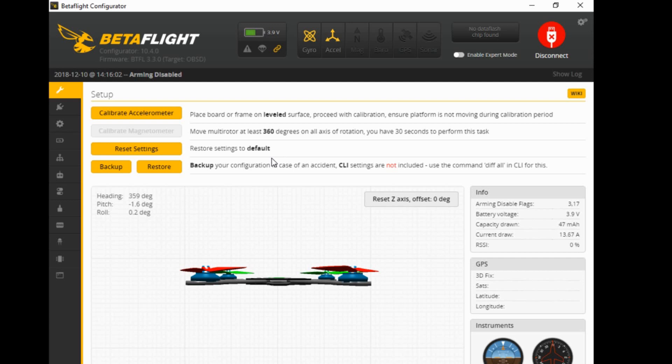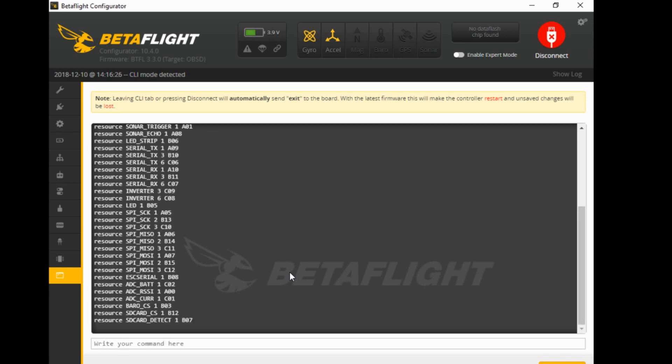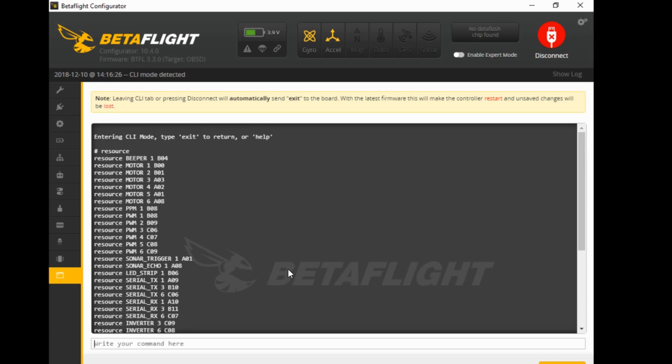So how do you switch it around? It's not that difficult - re-watch the video a couple of times if you're not quite sure, and leave a comment if needed. First of all, you have to go into the command line in Betaflight. I'm a lousy typist but luckily there's not a load of typing to do. You type in the word 'resource' and press enter. Now ignore all the other stuff that comes up - scroll right to the top.